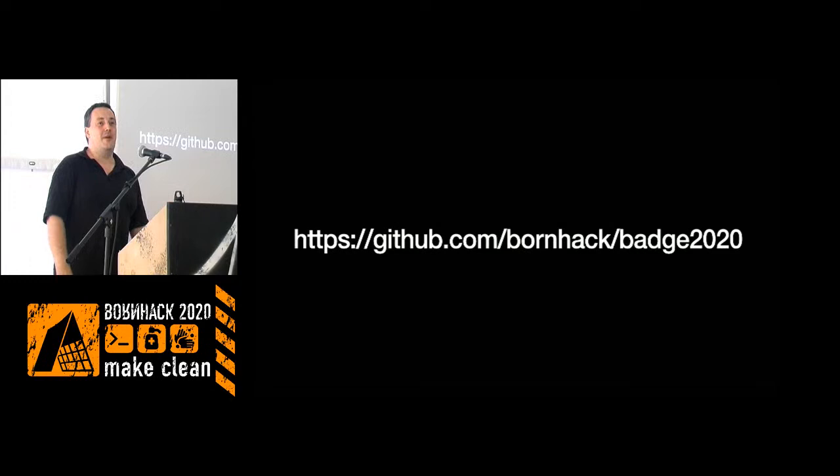And also halfway during this, nozzle three stopped sucking up the air to pick up the components. So we had to decommission feeder three and nozzle three, and then only have three feeders. That changed the time to populate a board from 6 minutes to 7.5 minutes. So even with the same parts, the same population, it's 25% extra time just because the feeders are different.